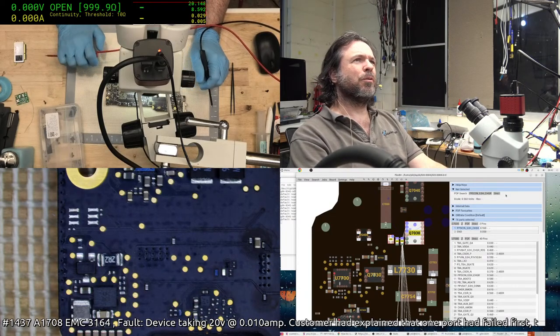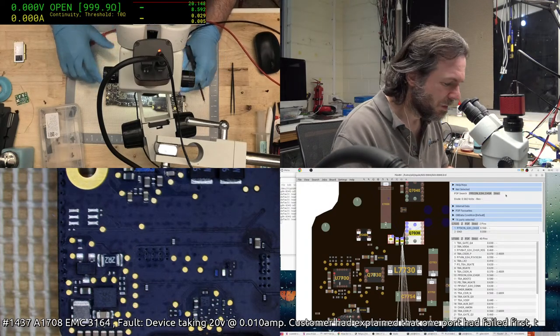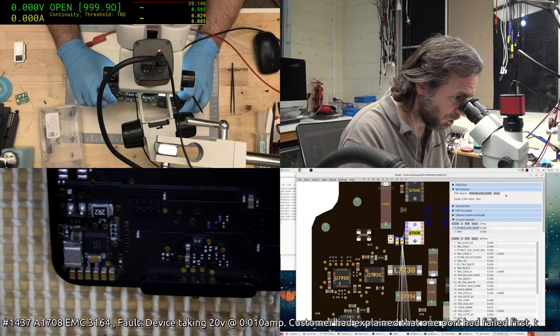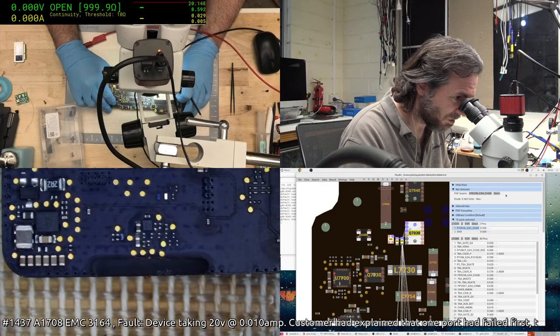So someone just bought your hard drive that they need to get data off. Two other computer places looked at it. One had opened it. Oh God, that's ruined. It's one thing if you open it, but then when you actually spin it up after you've opened it, that's usually the death.